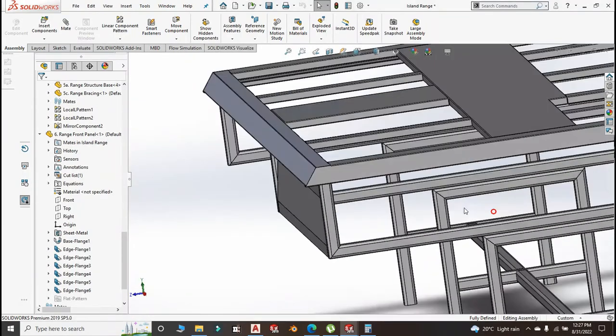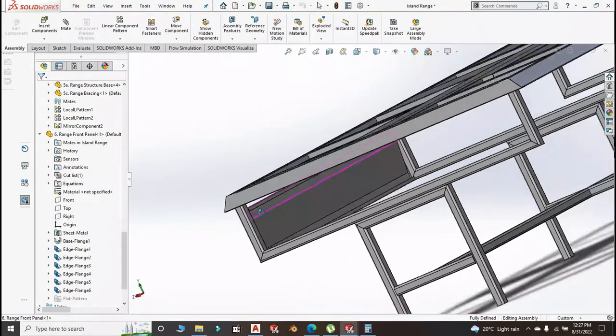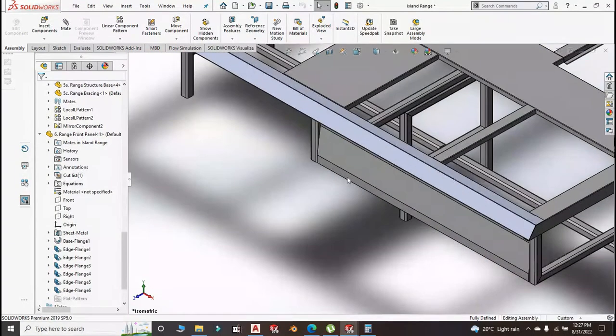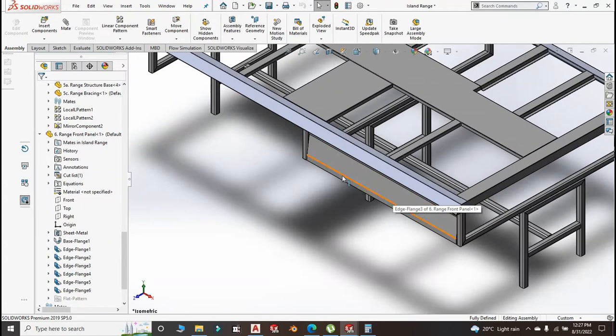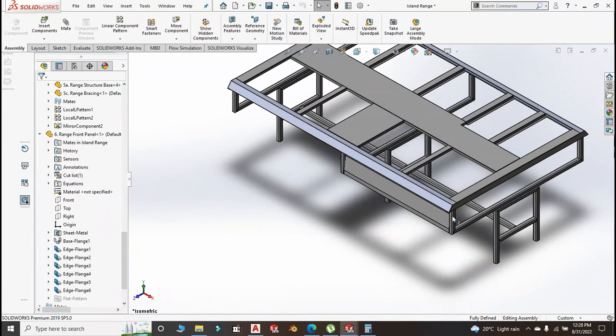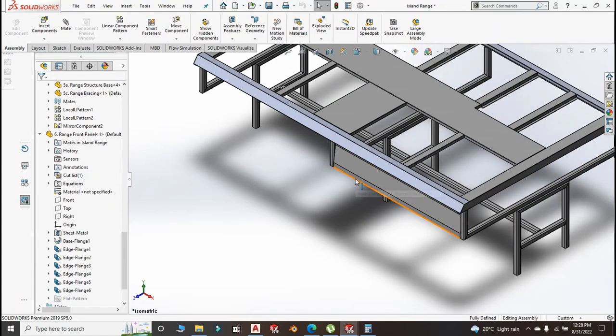Yes that's good — the panel looks much better than with that angle. It is within the square tube. As I was saying, you need this gap for aeration — the cookers and all that, the panels shouldn't be touching the top. Otherwise if you want to touch the top part you will be required to do some openings, punch some holes, to enable the cooking range to have good air circulation to support combustion, because there will be some drip trays down here and this side panel will be blocking airflow.